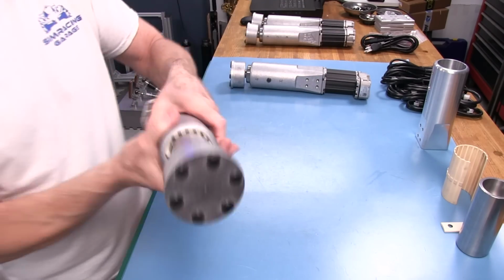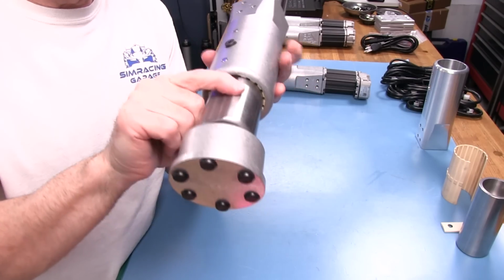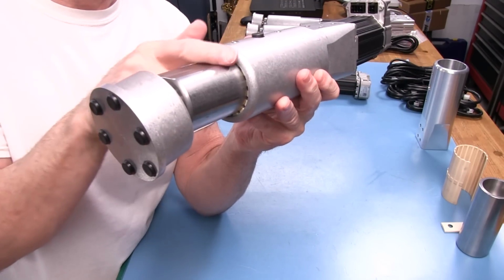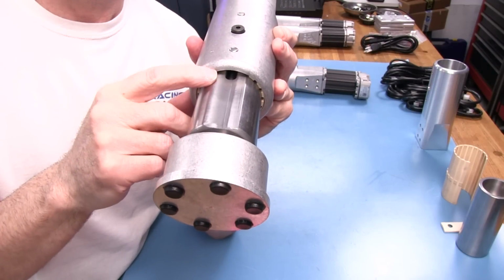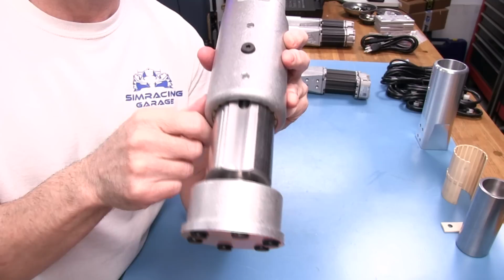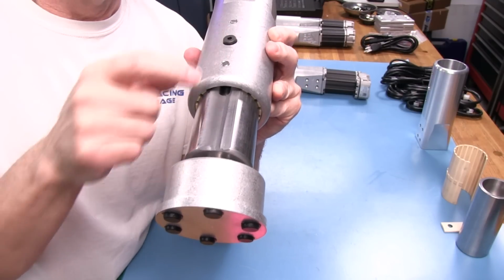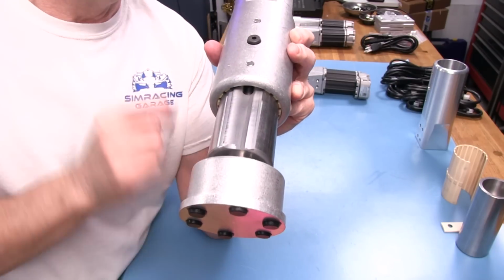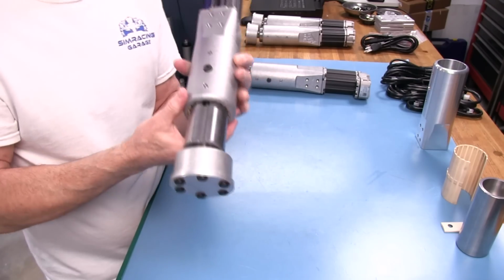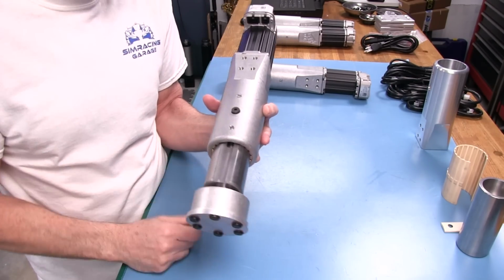This is a 50 millimeter piece right here. And there is a square piece to it. You can see that where they've milled this out to be square. And that's for the channel you see in there, the anti-twist element of this particular actuator. And this bolt here, I imagine that's what this bolt is for. So it rides down inside of that channel, keeps things from twisting around on us. That these tend to want to do because of the ball screw and the motor turning the ball screw. The torque forces want to make this piston turn.